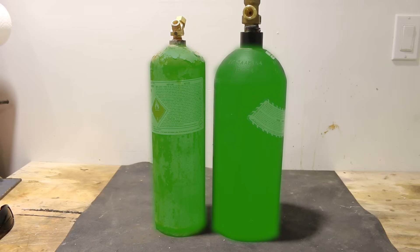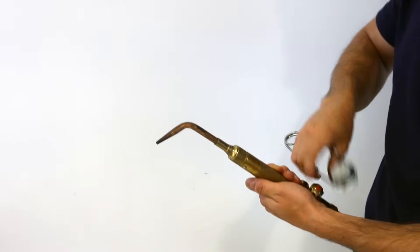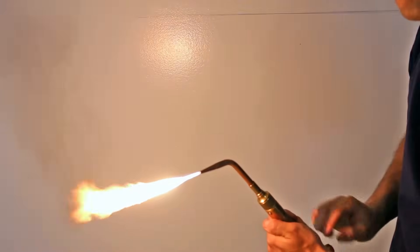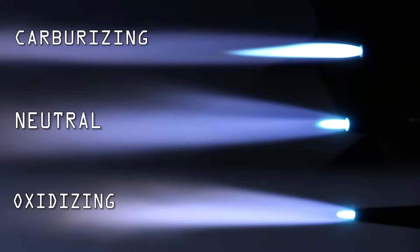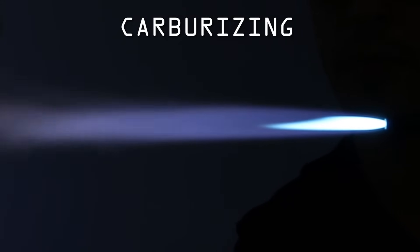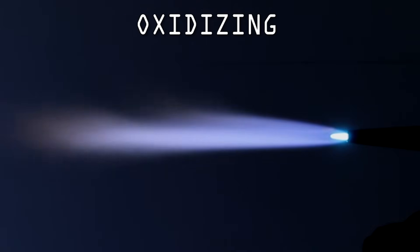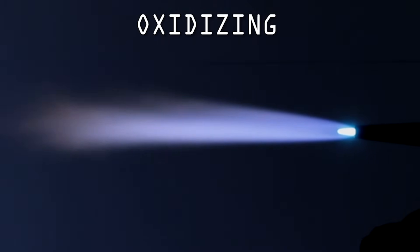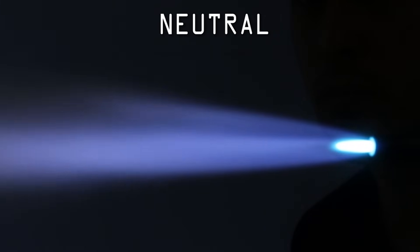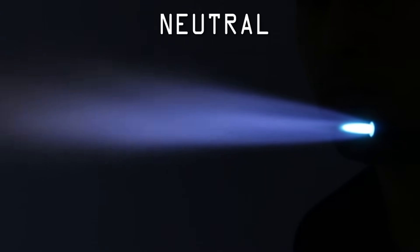Using the same pressure on both tanks means they'll deplete equally, saving you one trip to refill. Open the acetylene knob about halfway and light the torch with a striker — you'll see a mix of soot and smoke, which is normal. Wait for it to clear, then slowly open the oxygen side. There are three types of flames. A carburizing flame — distinguished by three colors — leads to excessive carbonization and can compromise the joint. An oxidizing flame will oxidize your workpiece, which is also unwanted. What you want is a neutral flame: a perfect mix of oxygen and acetylene, typically a clear blue color, that neither carburizes nor oxidizes.